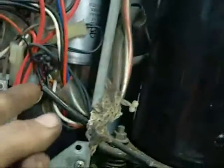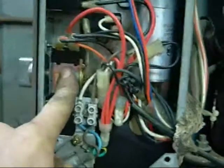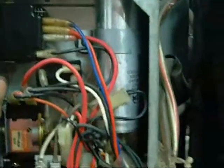The electronic side on this unit is a little bit more complicated than normal. This one has an electronic control module which uses a thermistor to detect frost on the coils. Many older ones just have a mechanical switch like a thermostat, which will throw it into defrost mode when the coil is iced up. A lot of old Kelvinators and things like that have a bigger version mounted up in here, which is your defrost timer. But in this case it's all electronic. I'm not going to pull the whole thing apart just to show you. That's just a rotary selector switch - nothing too special.